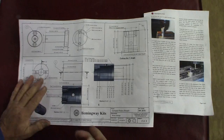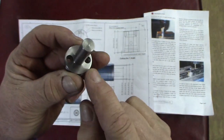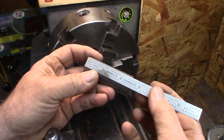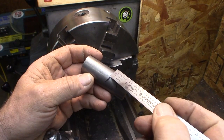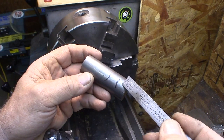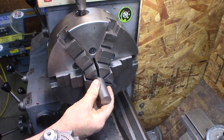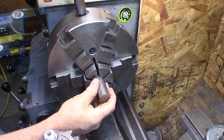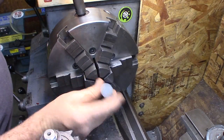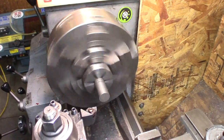Here's the completed part — it has a little slot, two holes, and those are counterbored. Let's go to the lathe and make this part. Material is two and a half inches long; the part is going to be approximately an inch and a half long. I'll use a six-jaw chuck. They say concentricity of this part is not critical, but you always want parts concentric. I'll put this piece in at half inch and face it off.